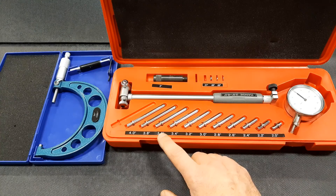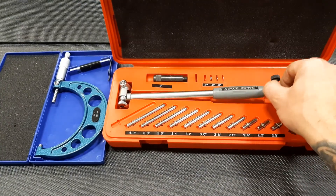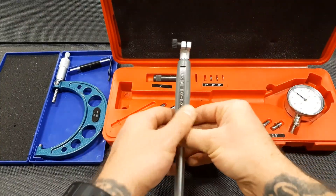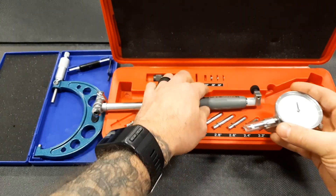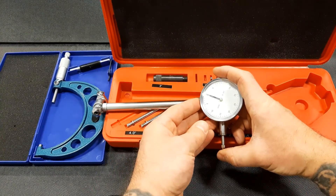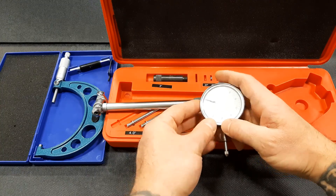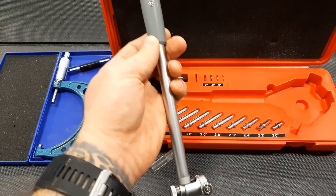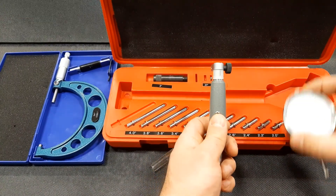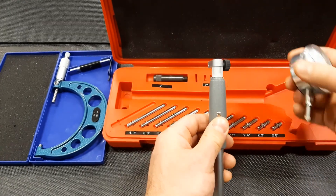We're also going to have to adapt them just a little bit longer because if I put this together the three inch and 600 thou isn't going to move our needle. We've also got selective thickness washers that we can use if we need them. So the idea is we'll take our handle and dial indicator and put the two of these together. Take the protective cover off — this dial indicator works just like any other. As the plunger is depressed the indicator is going to move around. To assemble this we're first going to have to attach the dial indicator, loosening off the thumb screw at the top, and inserting the dial indicator.